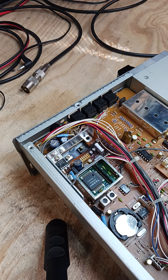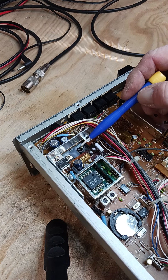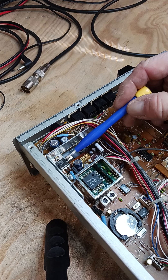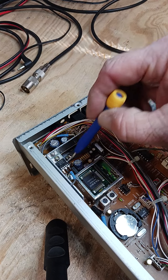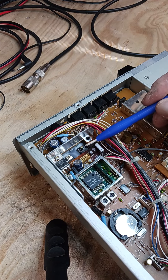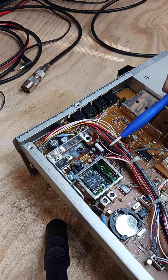This one was a little unusual. Typically the screen just flashes or blinks. But on this one, when you adjusted the RF power — say from low to 50 watts or QRP 10 watts, then bumped it back up to 100 watts — at full power the screen would flash and shut transmit right down. You'd unkey the mic, key it again, and it would repeat. That's the stress of what this has caused — your transmit-receive voltages aren't going to perform correctly.